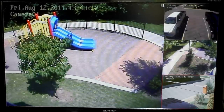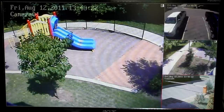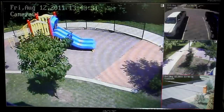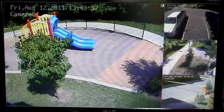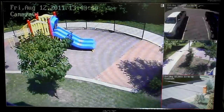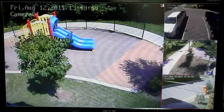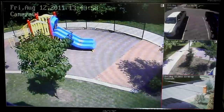We're running a hybrid DVR system with four analog cameras. The reason we're mixing between analog and digital IP cameras is they had some existing cabling already run for analog cameras. They were having issues with the analog cameras being vandalized and knocked and turned, so we've put on vandal-proof cameras — specifically vandal-proof domes — except for the gate camera, which needs a little more zoom and better infrared, so we've gone with a bullet-style camera for that.